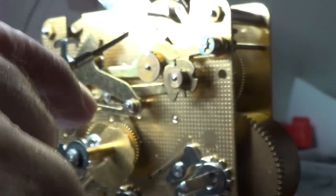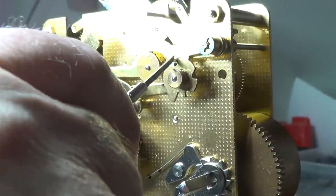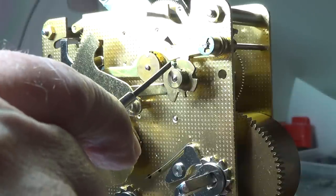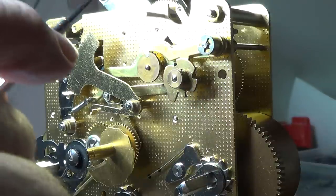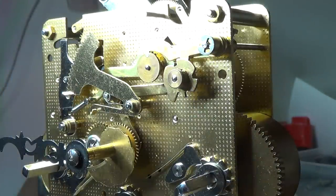That hook needs to be on that lever. So both those hooks have to be on that pin. And this piece has to be put on so that the follower has just finished the 3/4 hour strike. When you have that set up that way, it'll be in perfect timing. And then